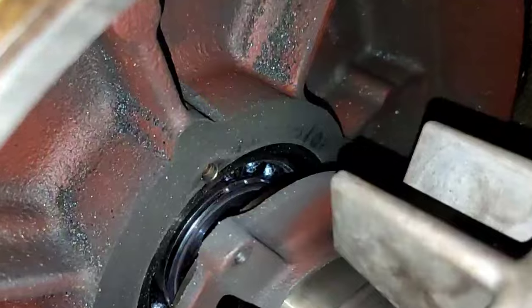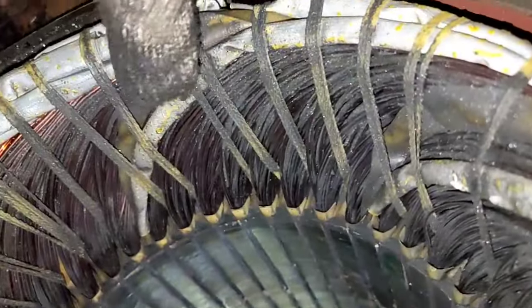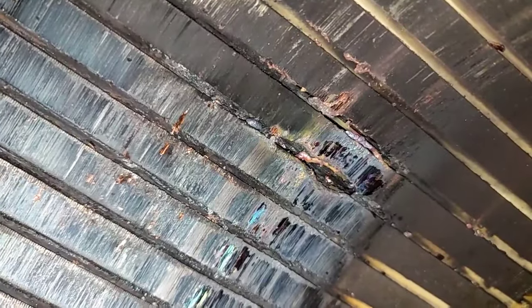By the way, the bearing is maintenance-free. Next month we have dry dock, but unfortunately this bearing is kaput. This is the situation of the rotor — the bearing is broken. Also, this stator winding is burned. That is the winding — it's also burnt.